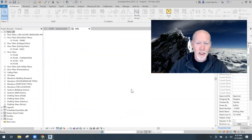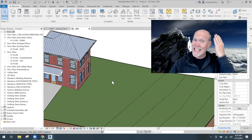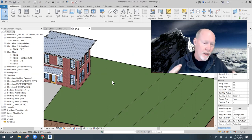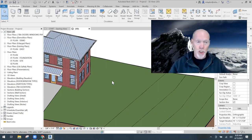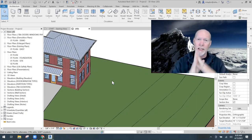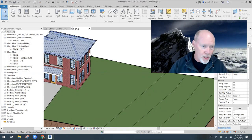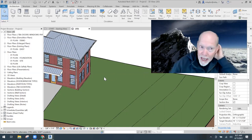Let's go to 3D and look at our building. Not too long ago I built a deck showing how you can make a wooden deck in Revit. One user asked how to cut a hole or shape through the deck. Another asked about a beam system for roof or ceiling joists poking out through the edge of the roof - how to cut all those off in one fell swoop rather than one at a time. This same technique works for both.